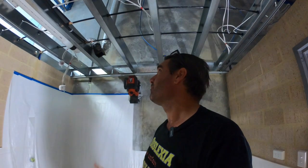He said this bathroom's alright, but any time the shower runs, it sucks up the moisture and just ruins the panels after a year or so. I don't want to be replacing stuff again. So he suggested: if you don't need it, just put the normal ceiling, put it slightly lower so we'll fit that new fan in. Once he's done, we can get the electrician in, then the painter to get it finished. Once he's done all the walls and everything, we can put our toilets and hot water systems in and get the ball rolling. There'll just be a standard ceiling in here.